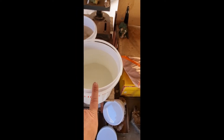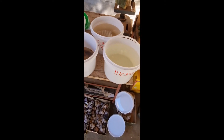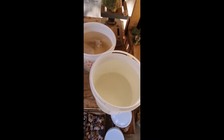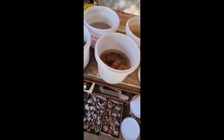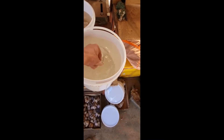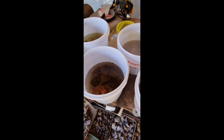We've got a bucket of bicarbonate of soda — always a very good idea when you work with acid to have something to neutralize it in case of any spills. I am a little blasé having worked with this stuff for so long. Your skin is covered with a layer of dead cells, so for the acid to burn you, you need quite prolonged exposure — it'll take that outer layer first. For instance, there's the hydrochloric acid everybody panics about, but if you get a sting and have little cuts on your fingers, just neutralize it.